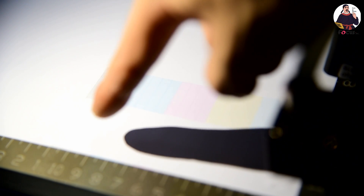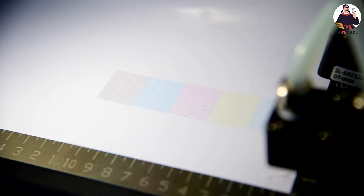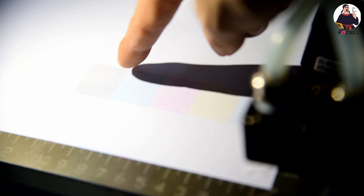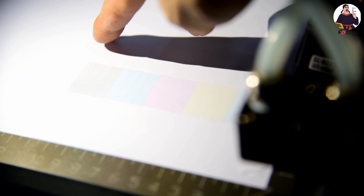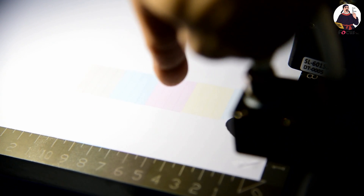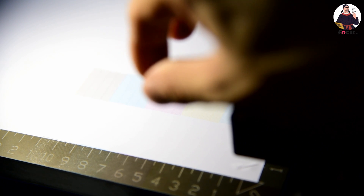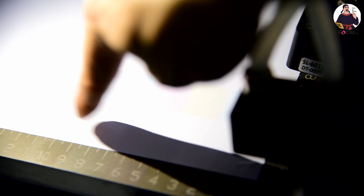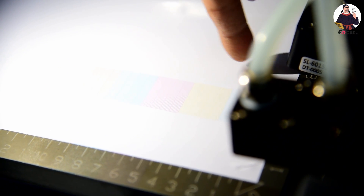At the front of the color strip is white ink. It's hard to see on white paper, but you can see it carefully with light. The varnish is also transparent, so it's also difficult to see on white paper. There are 6 channels for white and 6 channels for varnish. For best visibility, print on transparent film or glass, and make sure the varnish and white are printing as well as the colors.